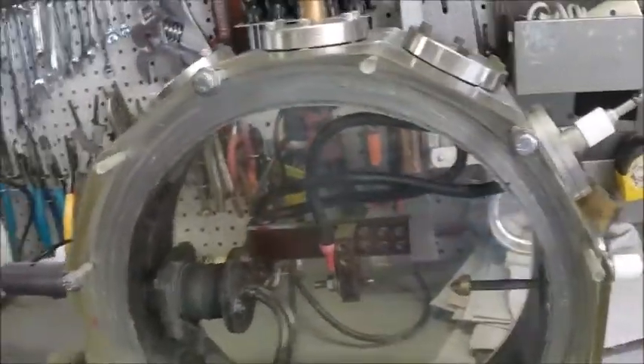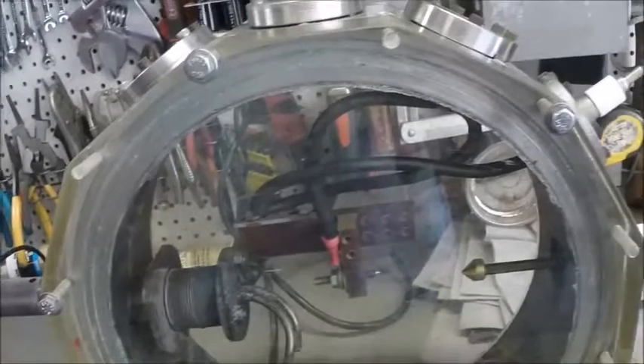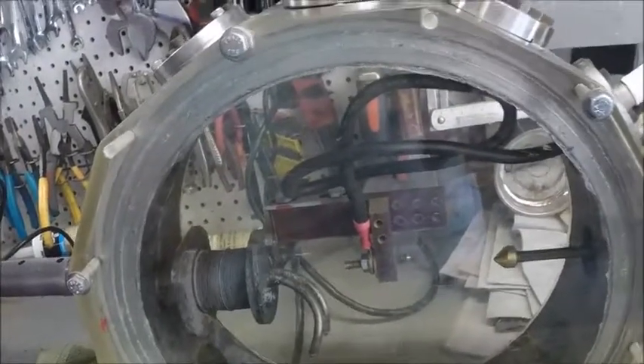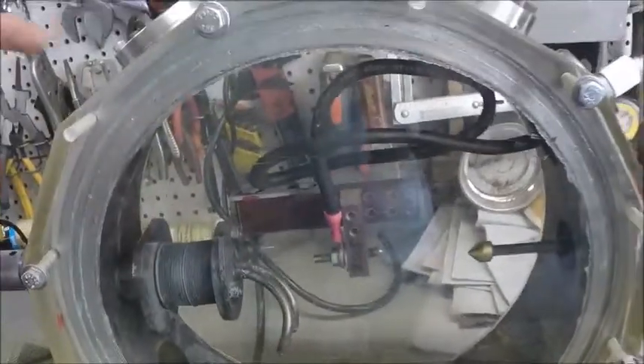This is supposedly mine. I've upgraded the electrodes a bit so I can get them further apart. Right now it's a 2.125 inch gap. You'll see that it hasn't increased the voltage jump that much. I think I could probably jump the full width or ionize the full width at 3,000 volts, but as you'll see it starts to jump to the casing.